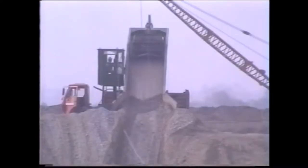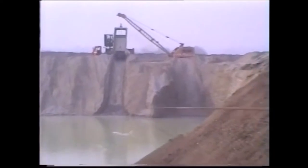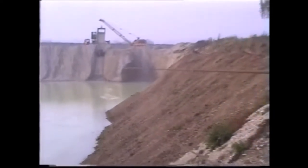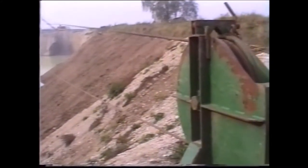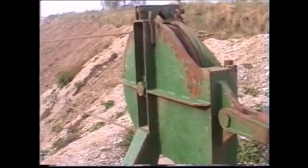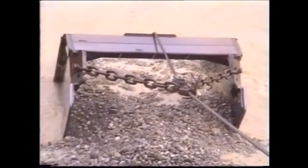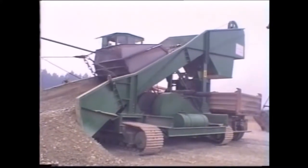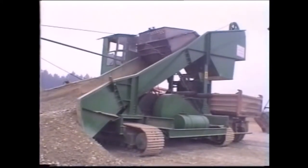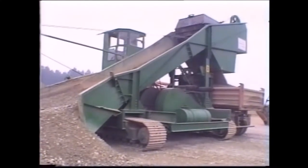In a further lorry loading scenario, the driver makes a small stockpile close to the ramp for rapid loading onto the lorry. On the opposite bank, the tail sheave for the outhaul rope is positioned and anchored in the ground. In the space of 2 to 3 minutes, the scraper driver has loaded the lorry with 3 bucketfuls. Proof positive of the efficiency of this scraping plant.